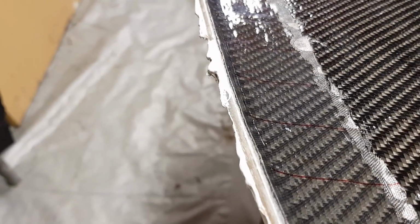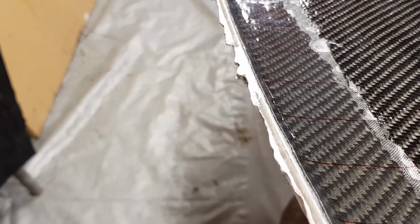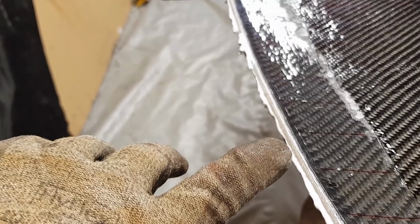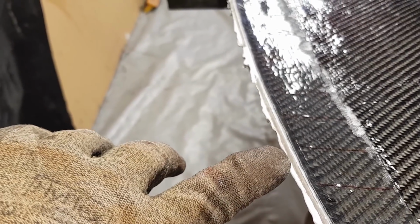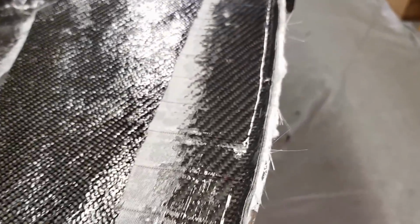Now, you remember yesterday I was talking about green trimming and how we're able to trim along this line. You'll notice here I've got a very defined edge between the mould, the white is the hull gel coat, and obviously the laminate. So I need to find that section there with my thin spatula in a place that's easy to lift out. A couple of spots over here.